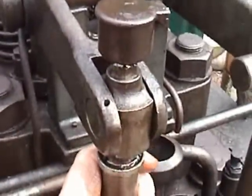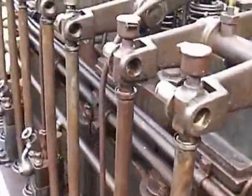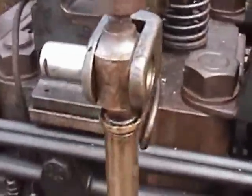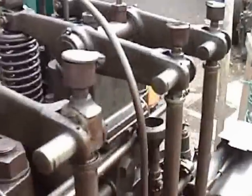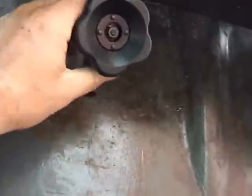This one's a bit stiff. All the pins are now out, so we can bar the engine round without operating the valves. We can now bar the engine round and check there's nothing coming down from any of the pistons or out of the indicator cocks.